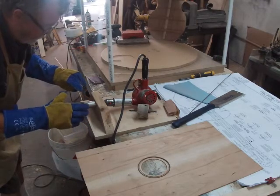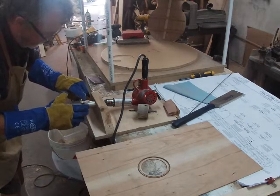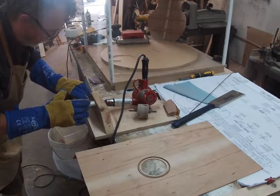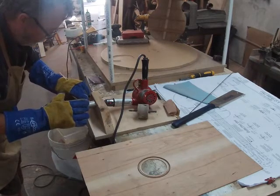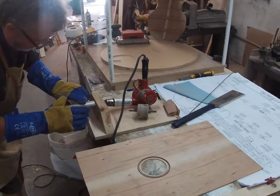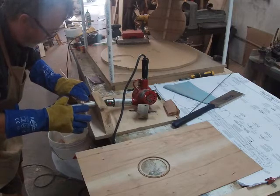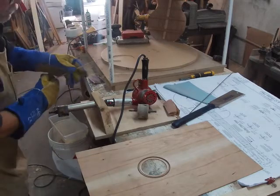Just like with bending the sides — if you get in a hurry, if you try to push it too fast, it'll break. This piece of maple is thinner than the first piece, and the first piece bent fairly easily, so I would imagine the thinner material would have bent even easier. The whole project is just a little bit at a time. Exercise some patience, and make yourself a circle.